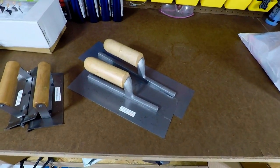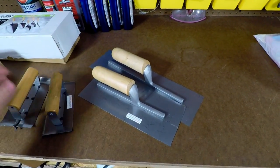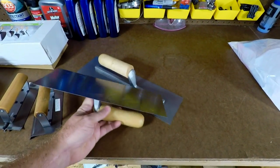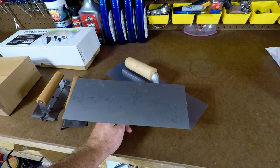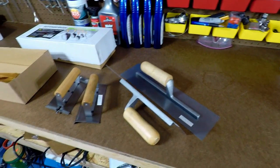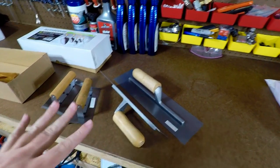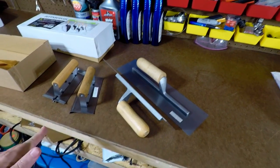The build quality is not bad. The wooden handles are a little bit cheesy. What you have to remember about these aluminum floats is you have to clean them right away. My recommendation is to pre-oil them before you even use them — you can use anything from old or new engine oil to vegetable oil to lithium grease. When you're done using them, clean them up immediately and re-oil them. If you do that, they'll last a little while for the price.